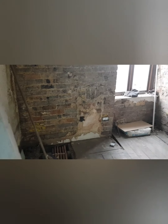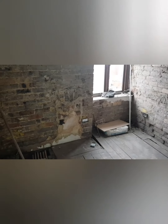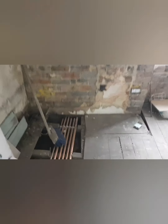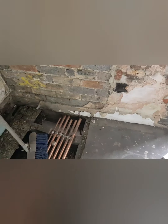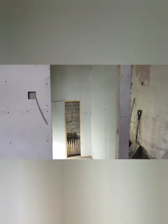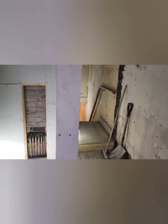Let's go to bedroom three - the door will be right here. You walk in, en suite on the right, which creates a hallway and usable floor area. This is where the last section of first fix will be done - it won't be done yet because down below we're taking the chimney out, so all this section will be extended afterwards. As you can see, all the first fix for the plumbing is there awaiting the wall coming down so you can carry on. There's the en suite. The wall's been boarded off as well - you'll find in a lot of old houses the walls aren't square, so that gives you a chance to hide your services right behind.